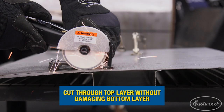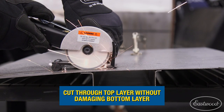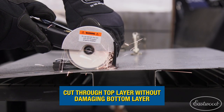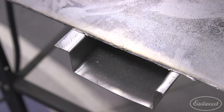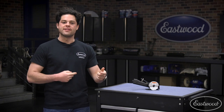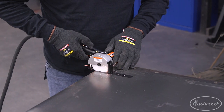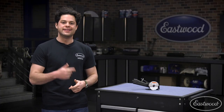This kit also includes a quick install depth stop, perfect if you're trying to keep the saw from cutting anything below the panel that you want to cut. If you have two layers of metal that are flat against each other, or maybe some bracing behind what it is that you're cutting, that feature is going to be a life saver. The blade also spins opposite of the direction you're pushing the saw, creating a pinching action which helps keep the cut under control — and the blade isn't going to dig in and run away from you in the opposite direction either.